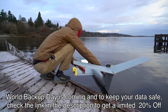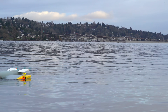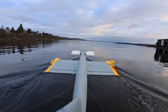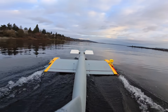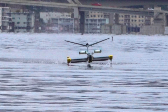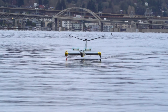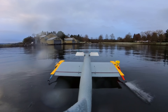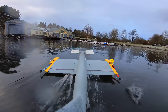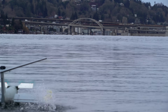Now back to the ground effect vehicle experiments. Let's see if this thing works at all. The handling in the water has improved significantly — the reason ground handling is so much better is that I have the water propellers set up to do differential thrust, so they help the boat turn. The water propellers give the appearance that they're operating as intended, but whether or not they're actually doing anything useful is a harder question to answer. We'll try to figure that out over the course of the video. That was pretty sick.